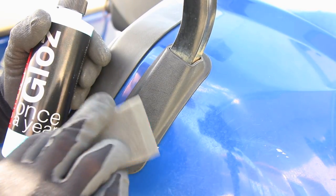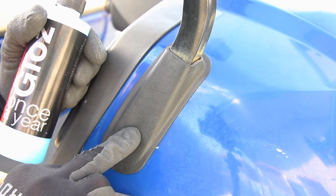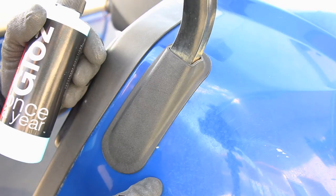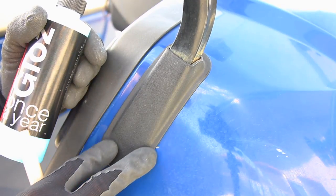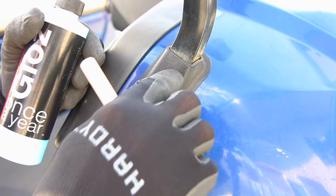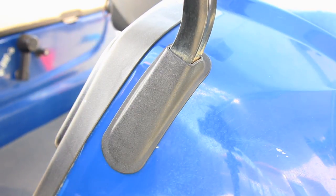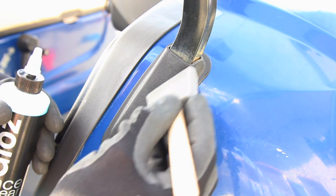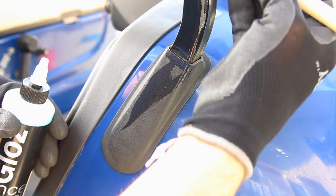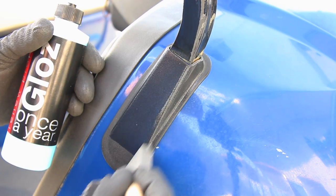One thing you'll want to do is seal all your plastics, rubber, and vinyl before buffing the gel coat. That way you've sealed over the porous surface and your polish or sealer will not haze and get into the porous surface of the rubber. If you like, on these dull painted surfaces you can wipe on a coat of the gloss, the satin, or the black.